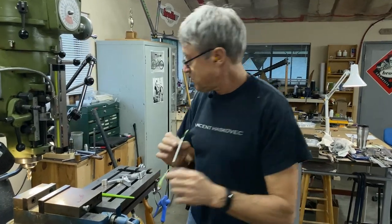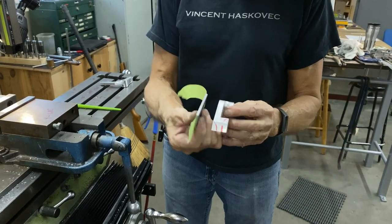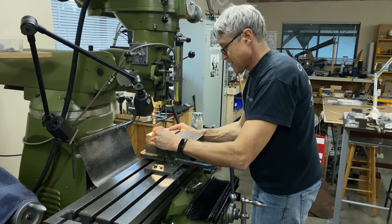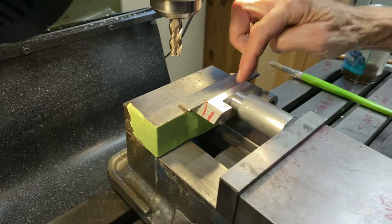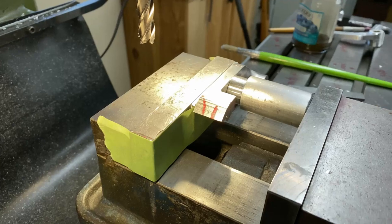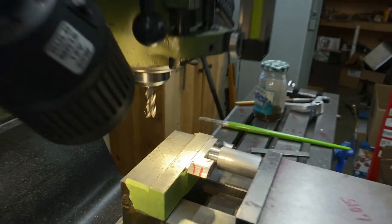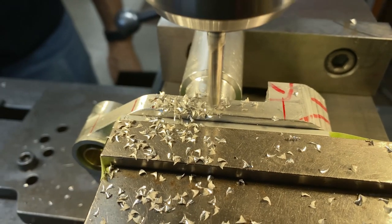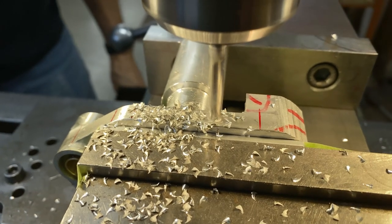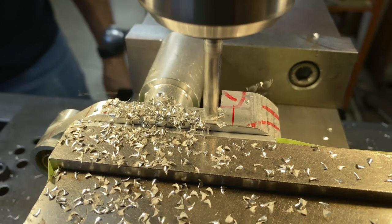I'll make a mark because this is where we're going to use the ball end mill. It's just nice if everything is consistent. I'm using eighth-inch aluminum because it's hard to clamp this in the vice when this piece sticks out. I'm just using my finger — I can feel it raised up a little bit here and a little bit there. And just to take a little bit of weight off and give it a little bit of style, it's a quarter-inch end mill and it is carbide, but it's also a little flexy, so if I go too fast it'll flex the end mill. I'm just taking a nice light cut.